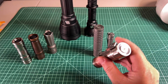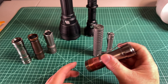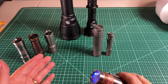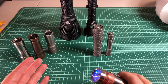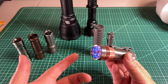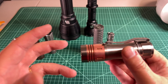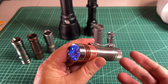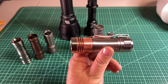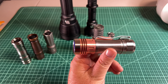That's in contrast to the next light we're going to talk about: e-switches. On an e-switch, the switch is always live because power is always running through it. For example, this light has auxiliary lights on, whereas the mechanical lights don't because power is cut on those. Since power is always on on this Emisar KR4, you can have auxiliary lights running while it's, quote, off. This confuses people when they first get a D4 or KR4 — they don't know why it's not turning off. Your TV looks off but isn't fully off, or else it wouldn't respond to the remote.